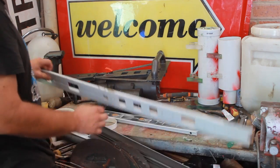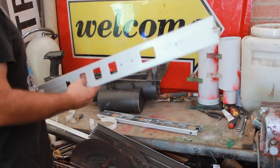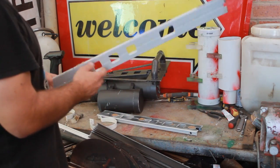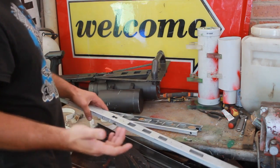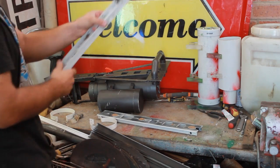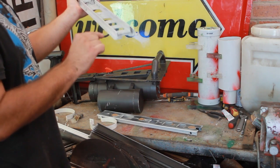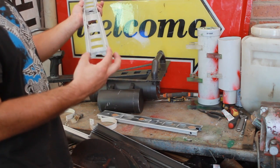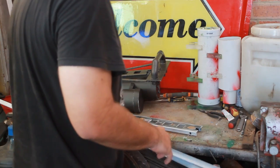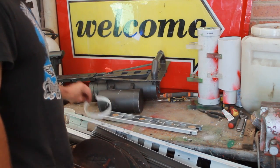What I'm going to do is cut this to size, give you guys the measurements on screen, and then we'll go from there. This is going to be different in your case because you guys might use something different. I'll just make sure to give you this width. Just keep in mind when you do get a piece of metal, whenever the aluminium has 90 degrees, equal angles, because it gives it extra strength, because aluminium isn't very strong, but in this shape it is very strong. I'm going to cut two pieces, cut them and then put it together on camera.